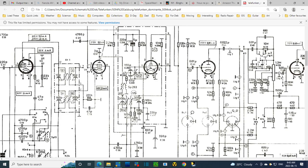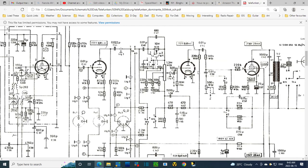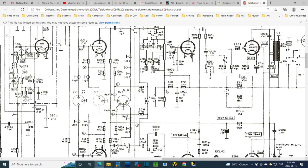Okay, what is this to? It's another amplifier. I got the preamp, you got a preamp, or phono amp, preamp, power amp. The biasing here looks like it's kind of self-biased. Big resistor here. This capacitor is questionable. So all these blocking capacitors, I'm going to have to hunt them all down, I think, now, because I've seen direct evidence of leakage. And no surprise, either.